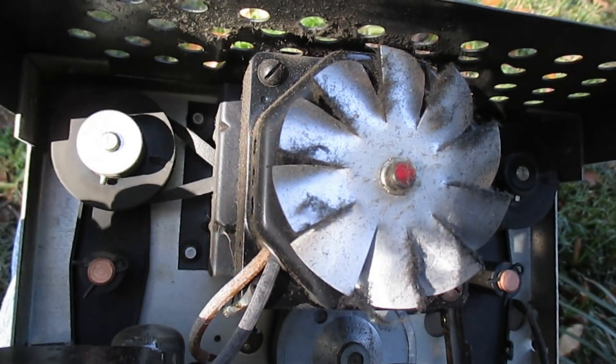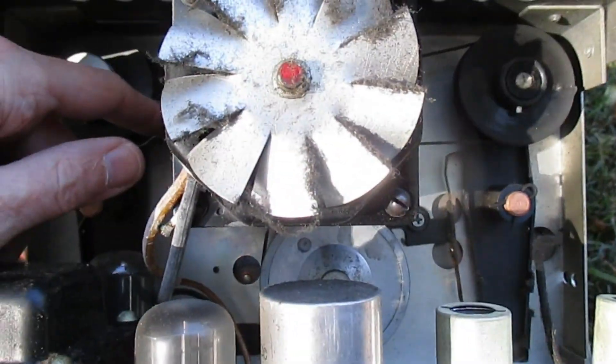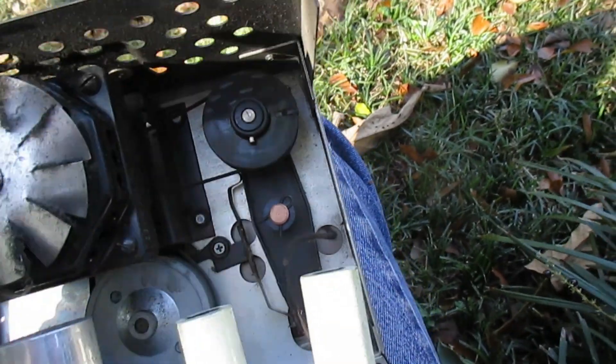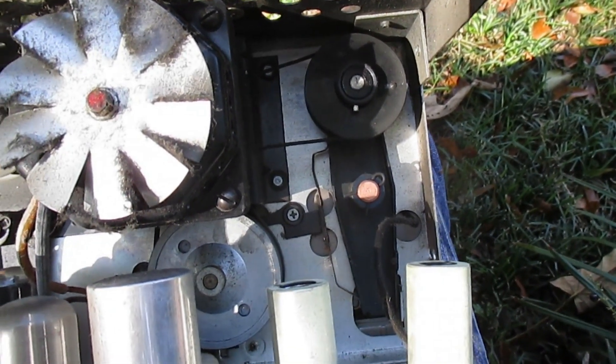There's a big AC General Industries motor, and I can see the belts are shot — this one's all cracked and dry-rotten, and this one's very loose. So yeah, this is going to need all new rubber, I'm sure.